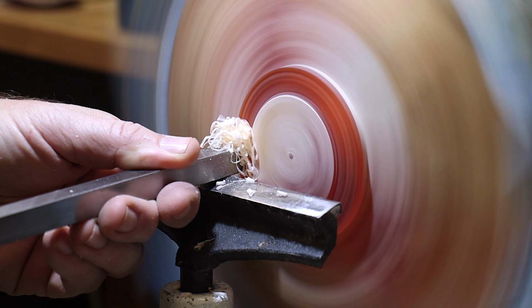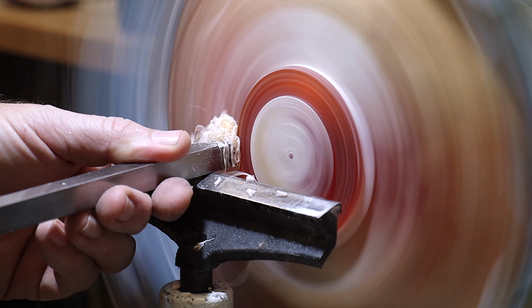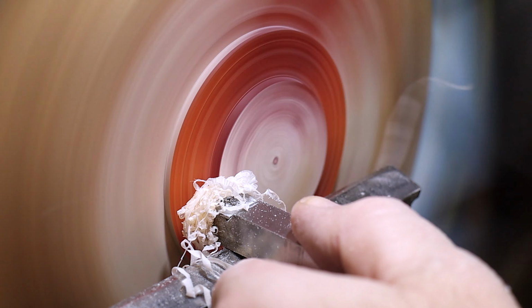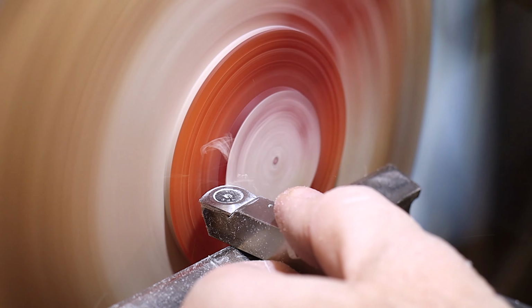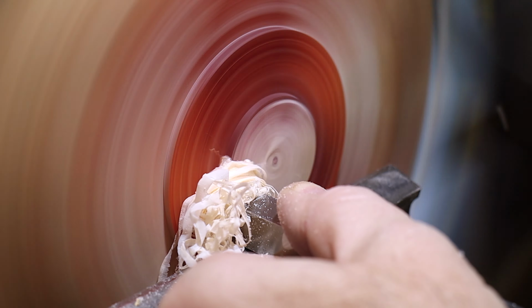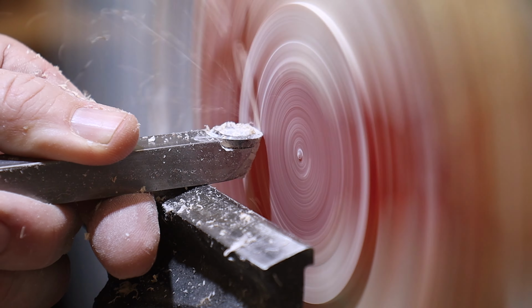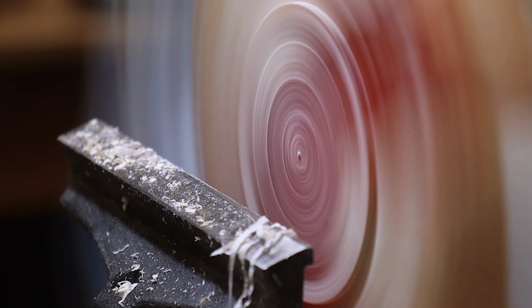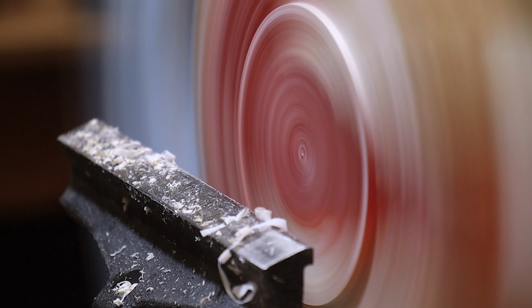On with the jumbo jaws, I slow the lathe down to the recommended 600, and I try to use the pushing action as you see me doing here, and I try not to put too much pressure going across the piece. I have had them come out on me, so here I'm just taking really light, careful cuts as I go across it, so just be careful.